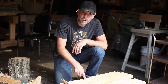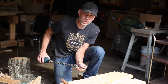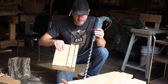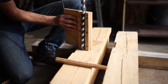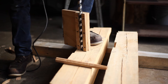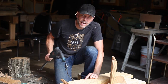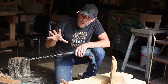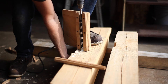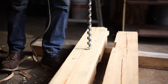We've found our mark and now we're going to use this auger bit, which has a screw tip on the front. I'll set that right on the mark, then use this jig I made to help us stay vertical all the way through. Something important: I don't want to drill all the way through the other side because I'd blow out the wood. So I drill until just the spur is sticking out a little bit, then flip the beam over and drill back the other way, which prevents a big tear-out.